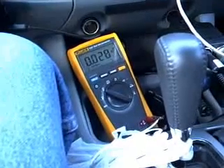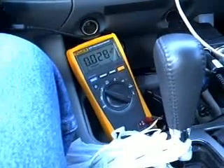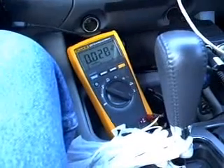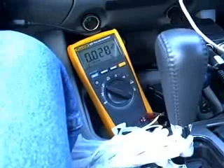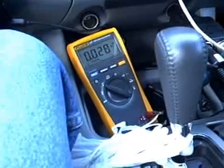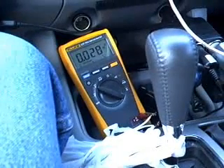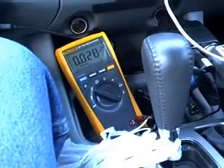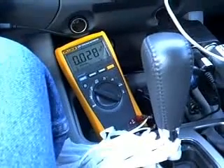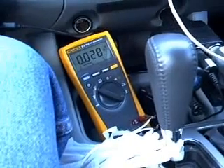What I want to do is increase the concentration of the electrolyte so that in its cold state it's drawing approximately 30 to 35 amps, which is what it would normally draw when hot. Now, if I were to pump straight DC into that cell, I could expect it to try and draw well over 100 amps when it got fully hot.